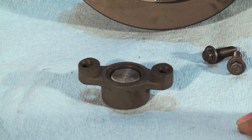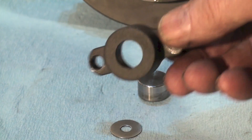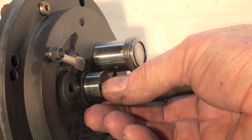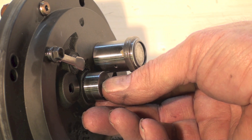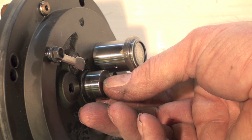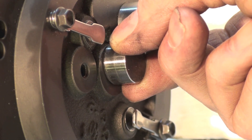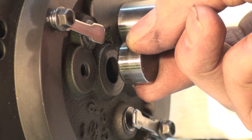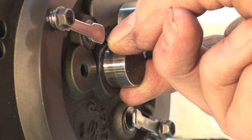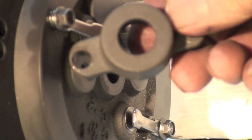When the unit is off, by gravity this thing drops down and sits in there. When the machine is off, this valve just sits down there, and that keeps the high pressure from backing up through the scrolls — the scrolls will actually run backwards if high pressure from the high side gets back into them. So when it starts up, it moves out and allows gas to go around it, then when it shuts off it just closes again. No spring on it, so the spring can't wear out, though I suppose it could stick.